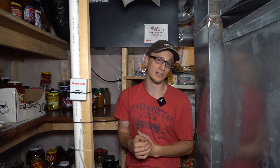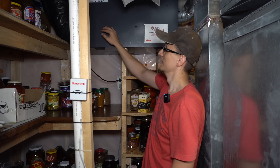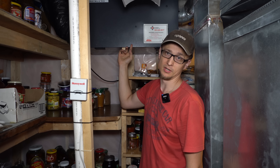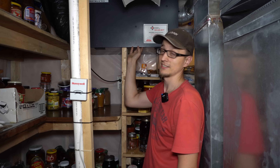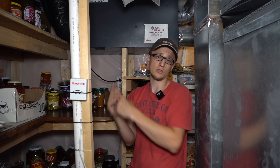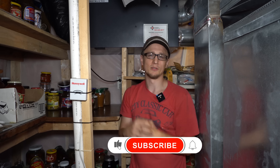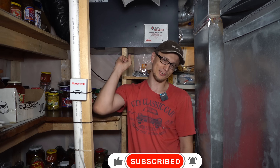And that's all I had to share with you. Basically, if you have an air-to-air exchanger, or if you go to somebody's house that has one and they're saying their AC is not keeping up, this thing should be off during the summer because it's battling the air conditioner — especially if it's on continually. So I hope you found this video useful. If you have any suggestions about the air-to-air exchanger or maintenance tips, please let us know in the comments below. Thank you so much for watching, don't forget to mash that like button on the way out, and I'll see you next time.